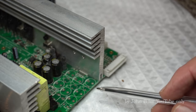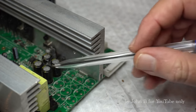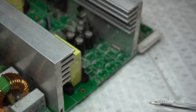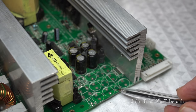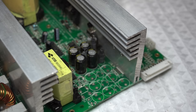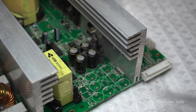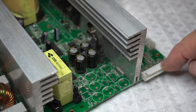And finally, there was no regulator for the plus 12, which we were missing. But after the diode from this transformer, T4, and you can see down there, T4. D25, not populated, and L9. And there's L9, so those vertical chokes for filtering. So L9, L11, there's not a choke on the other side, I didn't see. So no 48, no 5, and no 12. So that's all good. So this is giving us plus minus 15 to this connector only.